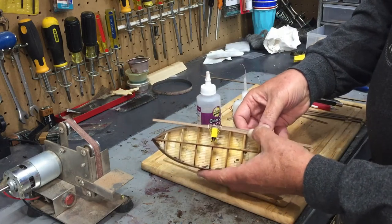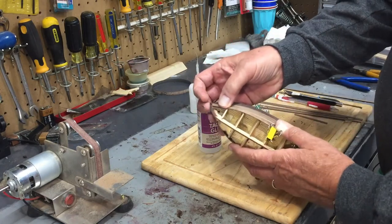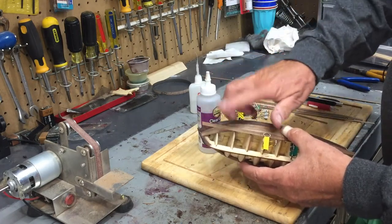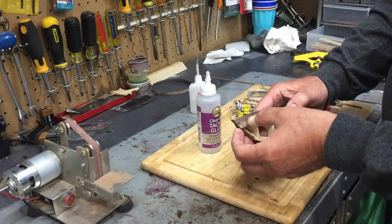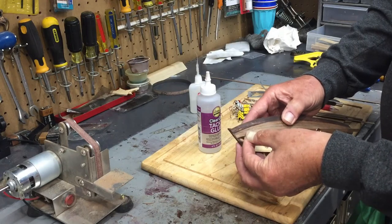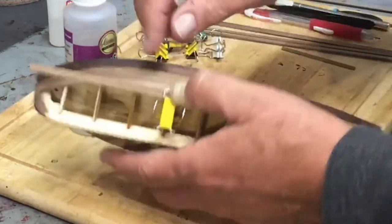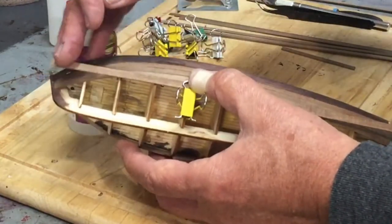I can do a dry fit now. There is a technique that is very labor-intensive for figuring out how to get these angled pieces to fit properly, because if you don't trim the edge, I've had a heck of a time getting them to fit. Now I've come up with a very simple way to do that. I push the plank close to where it would fit, then let it pop up, and wherever it starts to hit an angle I take a pencil and mark where it's dragging.